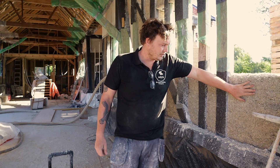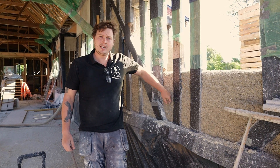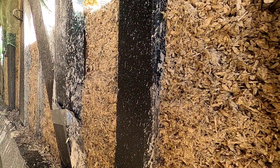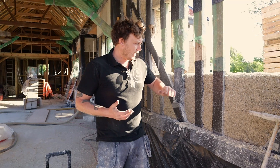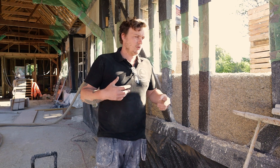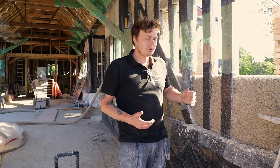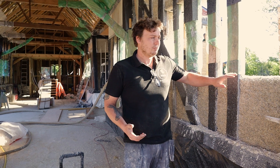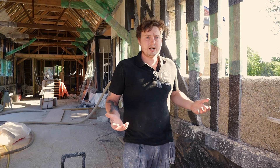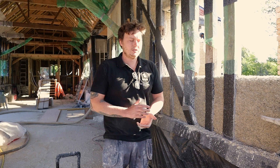You might also notice that each one of these panels is slightly raised or sunken compared to the next — it's a bit different. That's because we're in a really old building and we want it to feel like one. Everything is trying to match how it would have been: in an old building, your plaster wouldn't have all been equal in every panel because your materials wouldn't have been. It's purely aesthetic — we could bring everything out to the tops of the beams, but by the time you get your render on it just wouldn't look as nice.